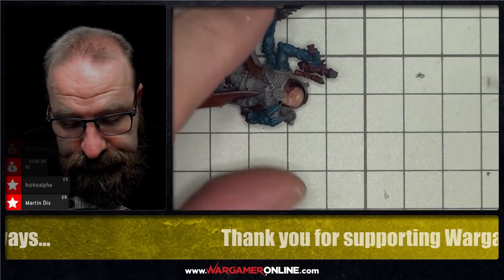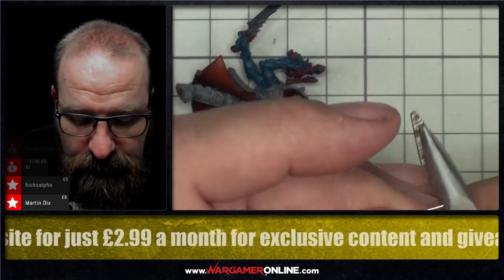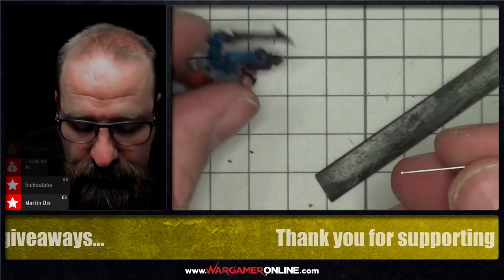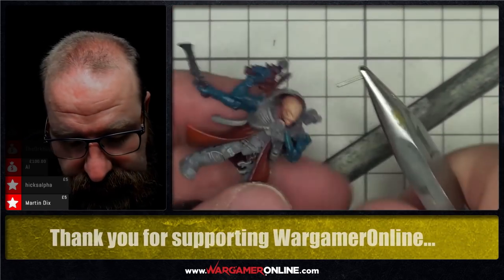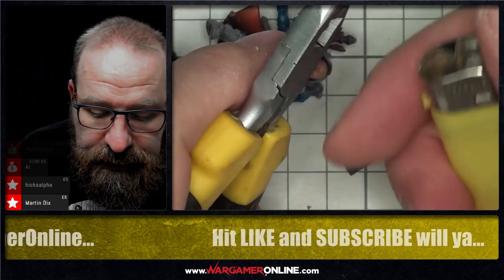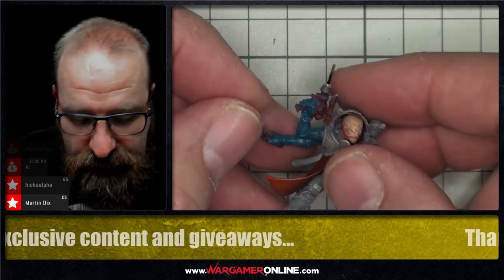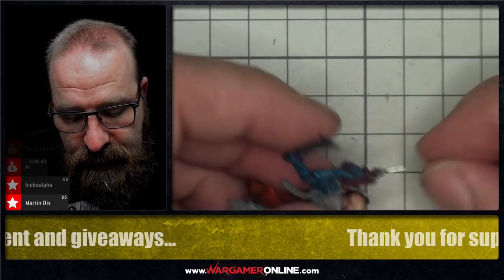I don't actually have a plastic part to replace this with, so I'm going to trim a needle down. I could use a bit of brass rod, but I'm completely out of brass rod at the moment, so we're going to trim the end off. Tidy it up a little bit, make sure it actually fits in the hole. I'm going to need a little bit of warming up, but that's not the end of the world. The hole's a little bit tight and I don't want to push down too heavy, so there's a solution for that — get the heat back on. And there we have it: one repaired needle gun. From having no solution to a solution, I'm pretty happy with that. By the time you've done a little blob of glue on there, tidied the edge up a little bit, and got some paint on that, you would never know.